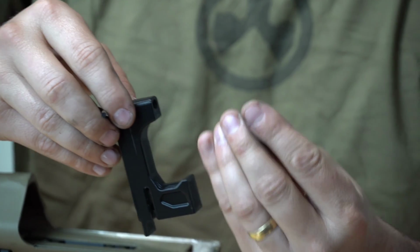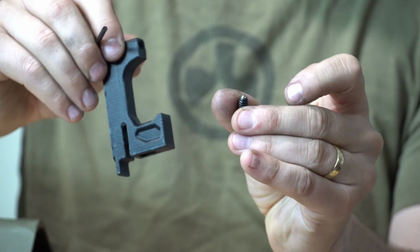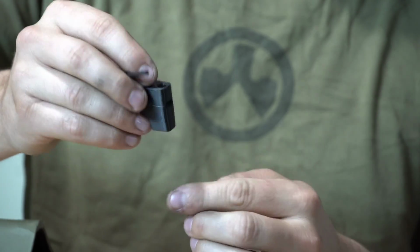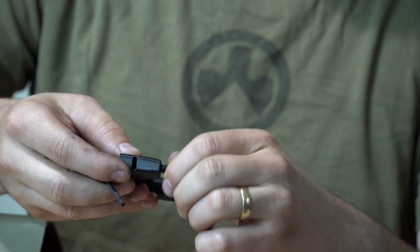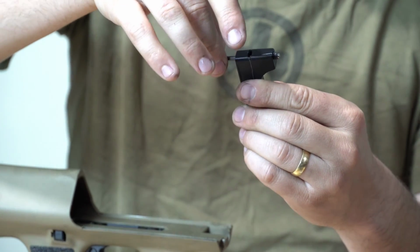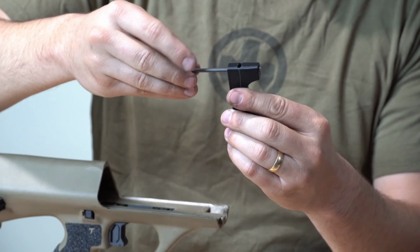Probably get it out. Hand tighten. That's all it is right there. It's got the hex drive right there, ball bearing on the end. It doesn't go in through the top. The top's not threaded. It's just straight wall there. But it is threaded in the bottom. So you actually have to back it in, as it were, to get it set. And then once it's engaged, reach in here with your 1/8 inch drive and bring it back for adjustment.